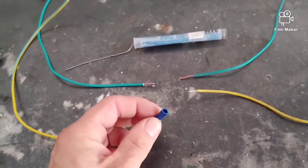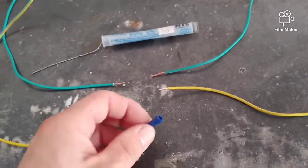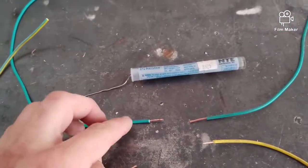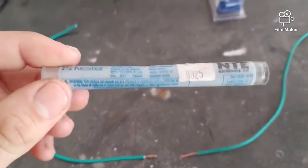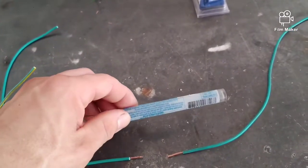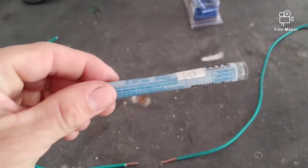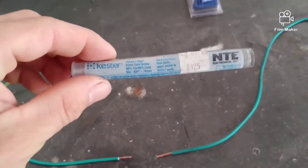For our test, I'm going to use some 16 gauge wire that you'll commonly find on your car, trailers, everything. I have a regular wire connector here — a crimp connection. The solder I recommend using is a 60-40 solder. I'll put a link in the description to a website that gives a good description of all the different types of solder and what they're used for, but for automotive needs or just soldering copper wire, I'd recommend 60-40.